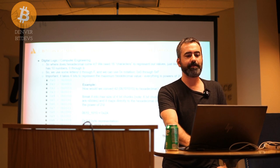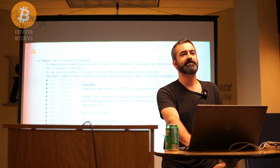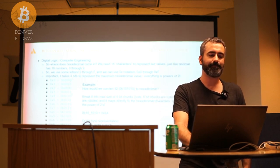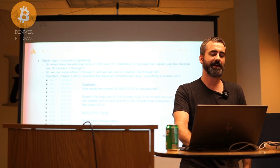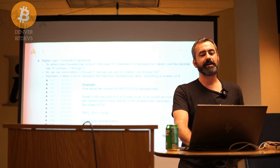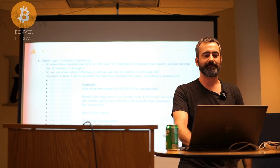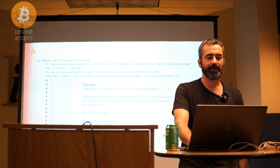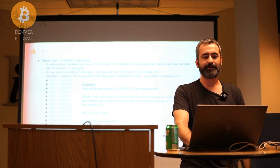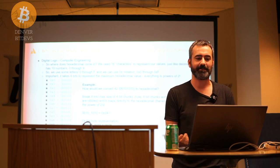Now I'm going to show you how we convert 101010 into hexadecimal. So 42, we can look up in our key. You can also just do the power of 2 math in your head if you're quick like that. And you can zero-fill, a leading zero in front of that, if you wanted to add in all 4 bits. But 0010, that's a 2. And 1010, that's an A. So hex 2A is 42, or binary 101010.